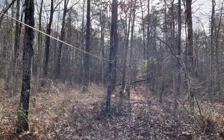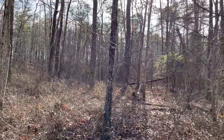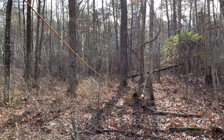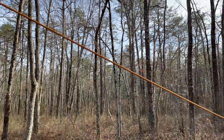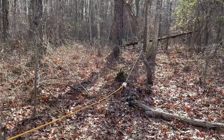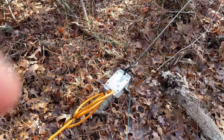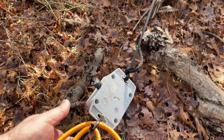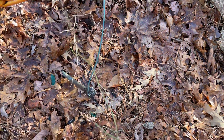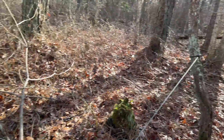As we get to the other end of this 300-foot leg of a 600-foot beverage, we get to the BevFlex terminating unit. It's okay if the coax droops and slopes down here to just a couple feet off the ground, where it's tied to a BevFlex terminating unit connected to a four-foot ground rod in the ground. The ends are just tied off to another convenient tree.